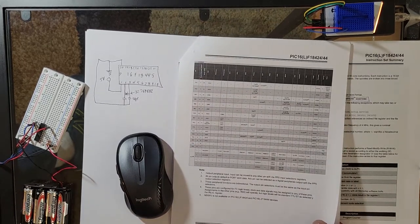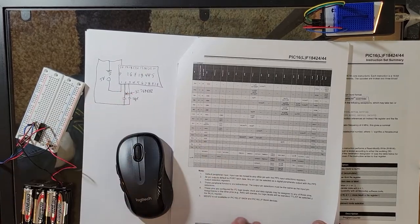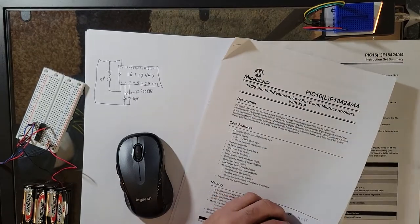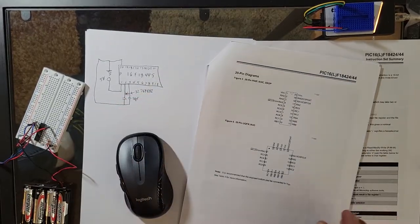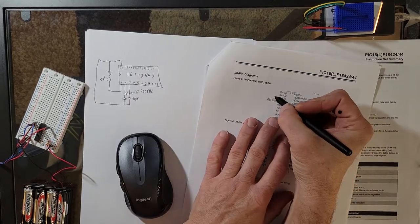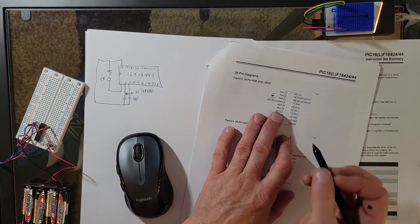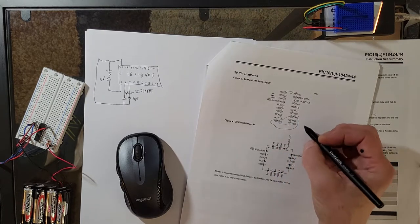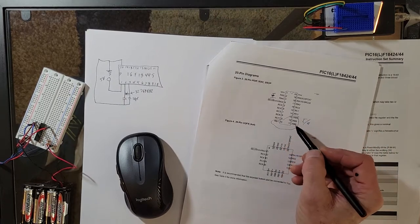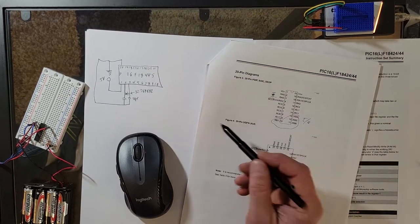Now I also want to put 4 lines on something. I'm going to put it on these ones at this end right here. So I'm basically putting it on one of the ports, and here we go. This is what we have here. So that's where the oscillator is sitting right here, right between here and there. And I want to use these four ports here for I/O. And I'll use 4, 5, 6, and 7. RB4, RB5, RB6, and RB7. So that's these ones right here.